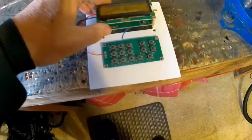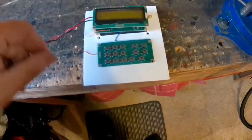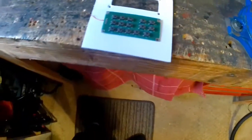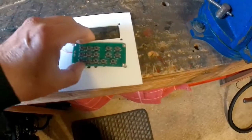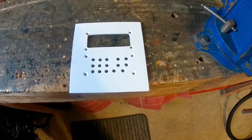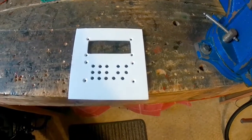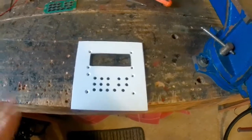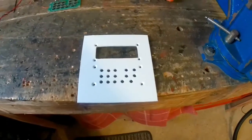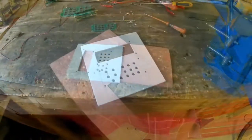It's going quite nicely. I've got to make up some spacers to space the boards. Because it's going to be a plastic case, I need to put some screening in it. I've got some self-adhesive copper-coated fiberglass strand material — it's a military spec screening material — and I'm going to put that on the reverse side to give some screening properties.